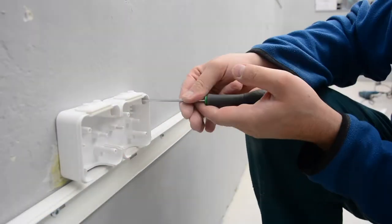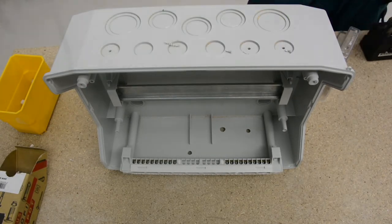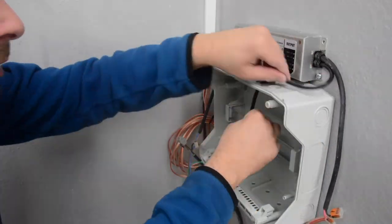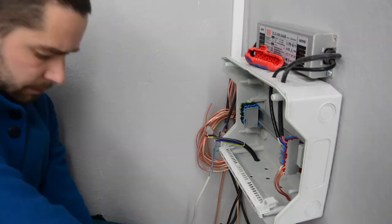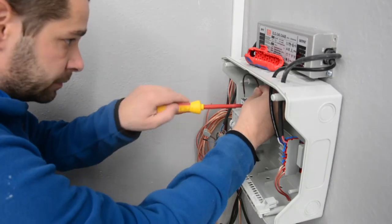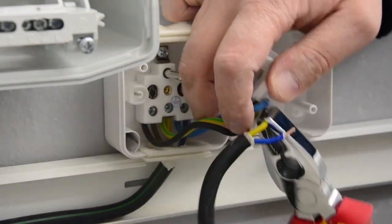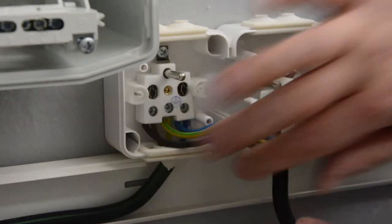Once I mounted all the hardware, I moved to wiring the control panel. Since I'm not planning to use combined three phases, I'm using three separate 16-amp B-class miniature circuit breakers. The idea is that when some equipment fails, it will trip the circuit breaker of that particular phase and not all of them, so at least the lights will stay on. I'm also adding an RCD, which is basically for protecting against electrocution. Once I have the workbenches, I will ground them via PE wire, as required by code.